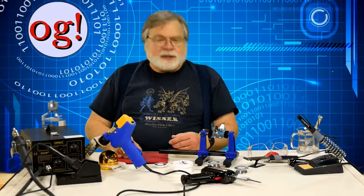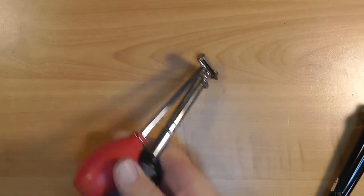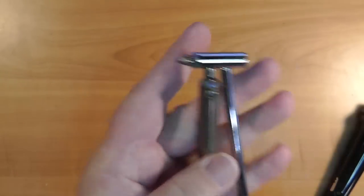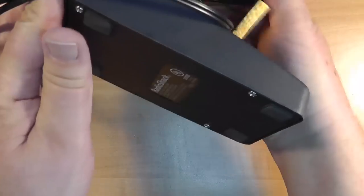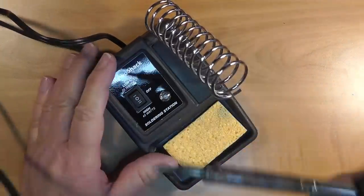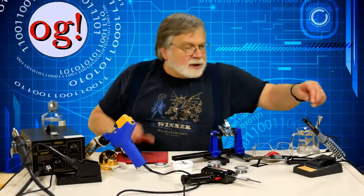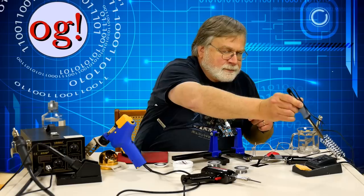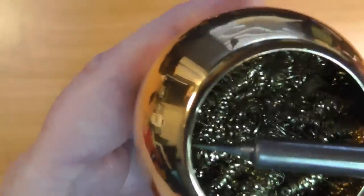I also have a spool of the same type of solder but 0.062 inch diameter — it's kind of big. There are some situations where it's handy to have some extra rosin flux for cleaning the joint to be soldered, such as when soldering surface mount components. I warn you that a very little flux goes a very long ways. This device holds the circuit board being soldered in place to free up both hands. Here is an inexpensive suction desoldering tool — very inexpensive. Next to it is the quintessential beginning soldering iron with heat controlled by limiting the power, and next to it, barely a step up, an iron that is either 20 watts or 40 watts. This set has a place to put the soldering iron where it won't burn anything — the wet sponge is used to clean the iron after each joint is soldered. Or you can use something like this HACO device that contains metal coils that clean an iron's tip.